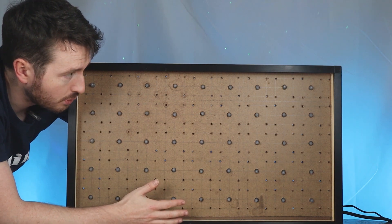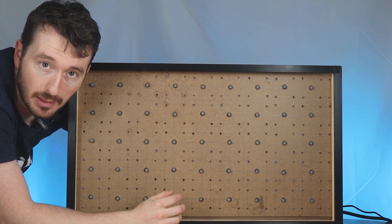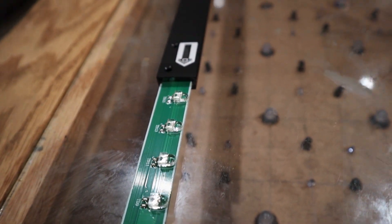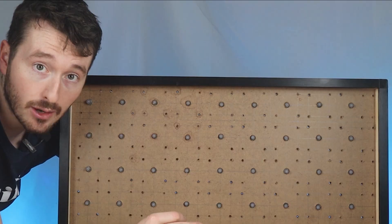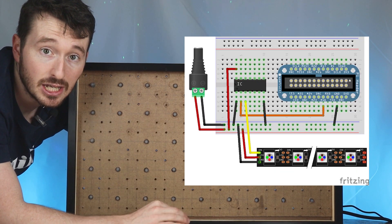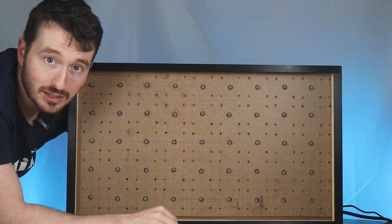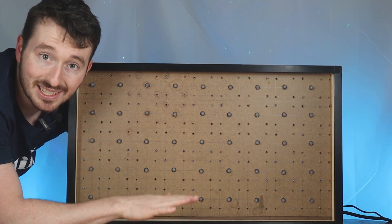To give you an idea of what the final product looks like, we're going to have this touchscreen around it. This touchscreen senses where your finger is — like a mouse — by utilizing infrared. Similar to the coffee table, there are infrared receivers on one end and infrared emitters on the other, and as you block it, it knows your position based on the disruption in signals. For the circuit, we're going to use a classic integrated circuit that steps up the voltage from the Raspberry Pi — which only outputs at 3.3 volts — to the 5 volt signal needed for the LEDs, powered by a 5 volt cable power supply.